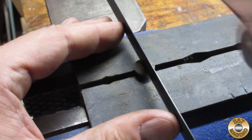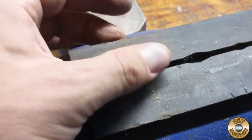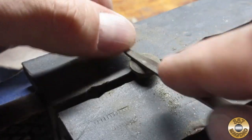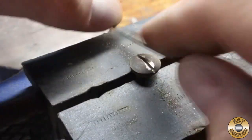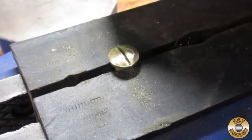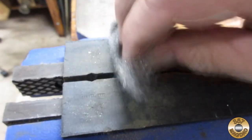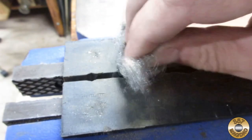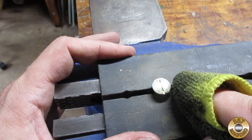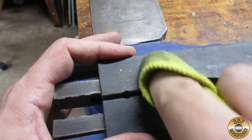Finally, I tackled the hardware. I used a hacksaw to clean up the screwdriver slots. I had to use a file in a couple of spots too. I sanded each piece with 600 grit emery paper. And then used some fine steel wool. Chuck was eating lunch, so he watched me flitz each piece from his birdhouse.